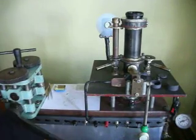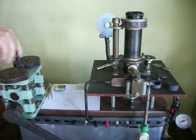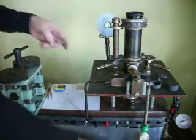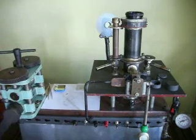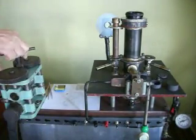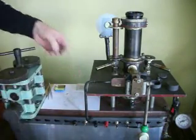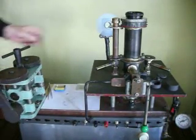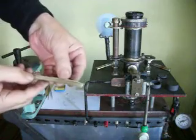And because graphite's precision is measured in microns, jewelry components and findings can be compared in precision and quality to die-struck or milled pieces, and the metal is repeatedly and always porosity-free. There's no fire scale or pickle to strip, and of course there is never any porosity. This strip is much easier to roll than an ingot, which every jeweler knows would take a good 20 minutes of rolling and annealing to reach this stage. Beautiful.